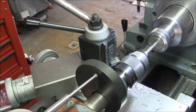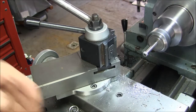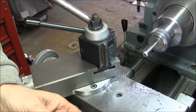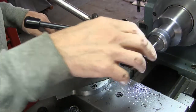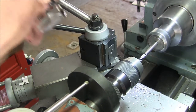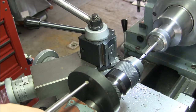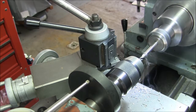Because it is a flat bottom hole I'll go to 650 thou depth. This is going to widen this thing out pretty good — not much wall thickness — but it's not like we have a lot of torque on this thing, so it ought to be okay.